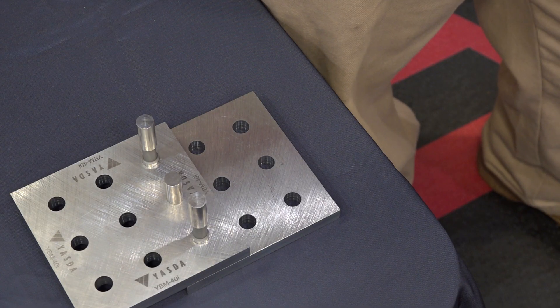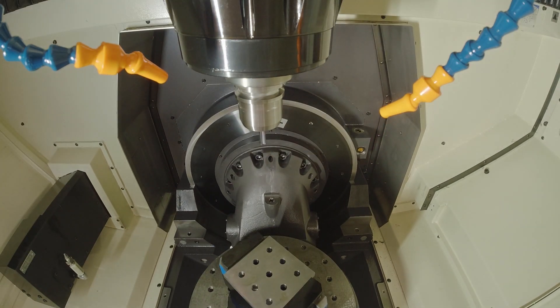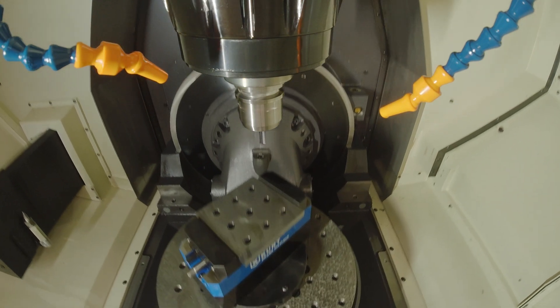And that's the ultimate precision when we think about what 5-axis machining does. As we get into bigger parts and expand from that Z0, that's where the difficulty comes into play — the further and further we get away on all of those different rotations. Absolutely. And each one of these holes was also machined at different degrees of C-axis, so it wasn't just straight on. We rotated at 45 degrees, 270, 90 — every angle that we could for all the different holes.